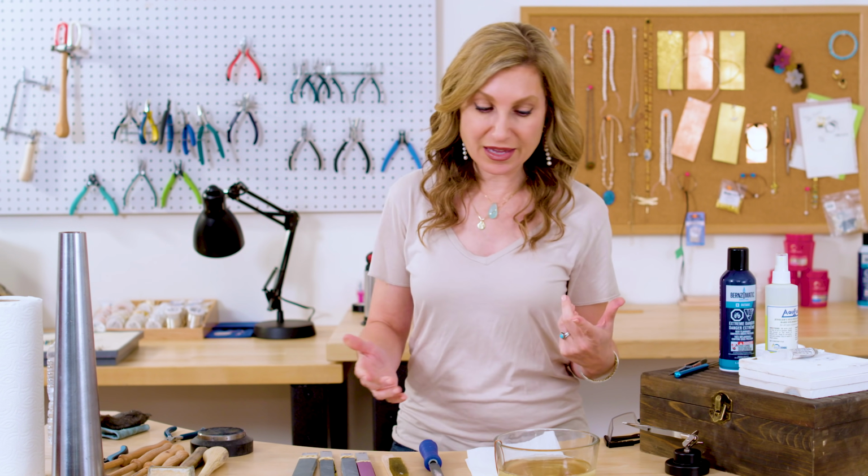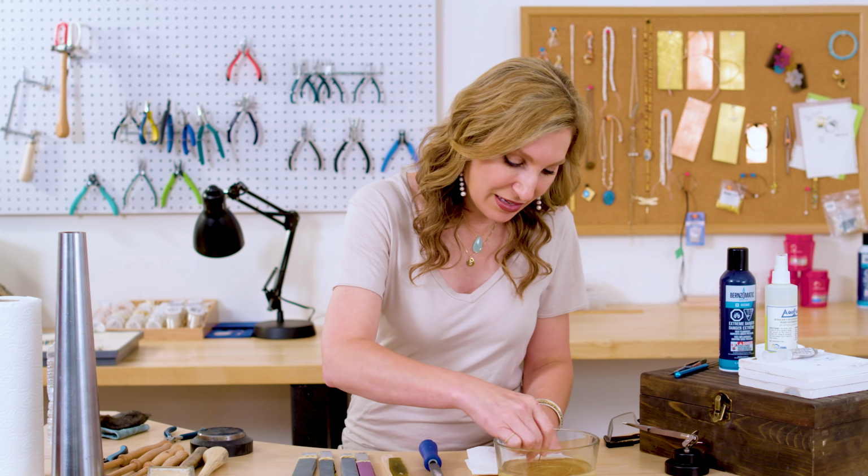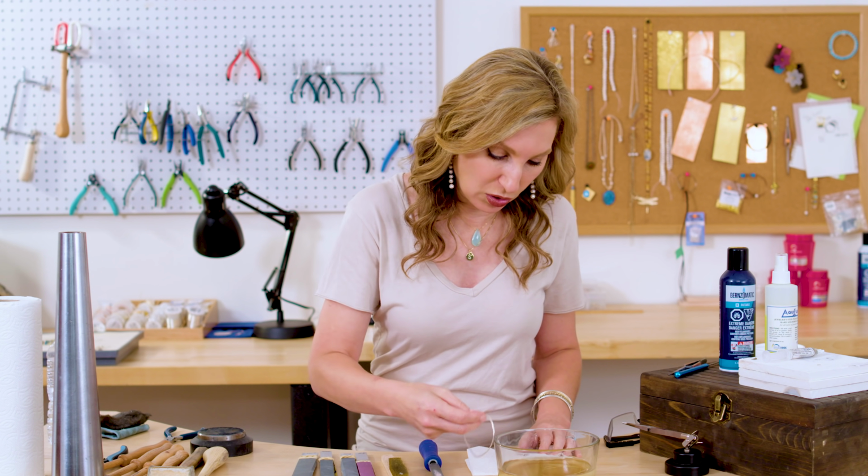And then the other thing is, when that solder flows, you probably saw it in the video, it gets shiny. What you're looking for is that shiny look, almost like a clear, mirrory puddle of water. It just goes whoosh, just like that. And when that happens, you're done. You've got to get the heat off of it. If you keep going, you'll fuse it or make a big blob, or you'll do it once and you'll know what I mean.